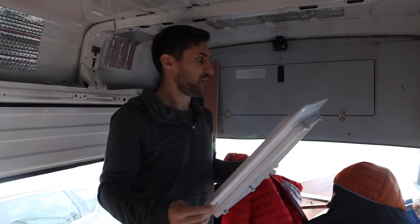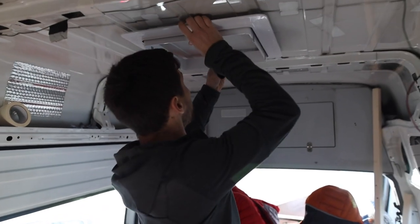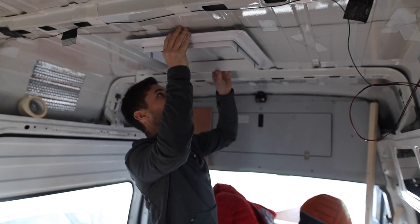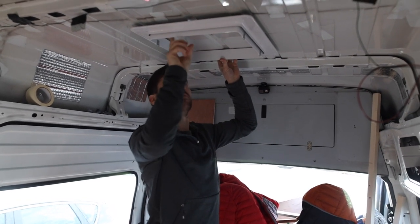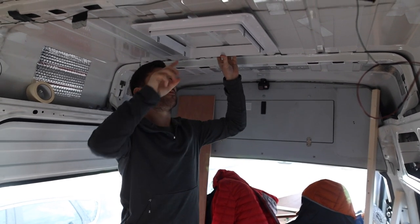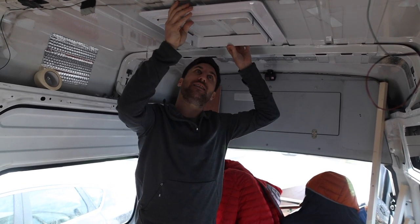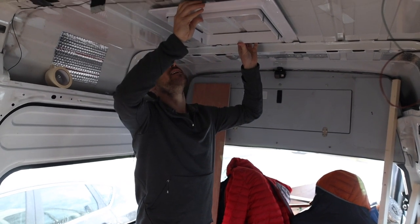What we do is figure out the centering. This needs to be centered out on there and then we'll put the four holes in the middle. We'll put four marks in the corners, draw through those, and then when we go onto the roof we can draw it all out and cut down with a jigsaw. So it'll be perfectly square and centered in the roof. Hopefully — that's the plan. Hopefully we don't get any rain.